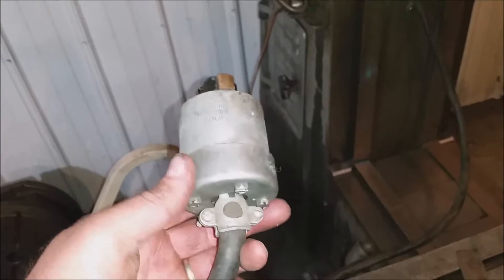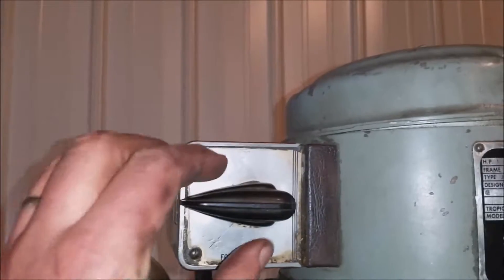So here we go. I'm going to go through real quick how the mill is set up right now and just show you how it is before I start, because a lot of times I see these videos about VFDs and they're putting them on but they really don't show you what they started with and some of the more intricate details. I've got this 480 plug on it — that's the way it came. It's got your neutral/off and forward and reverse switch on it.